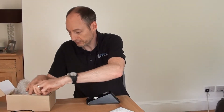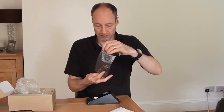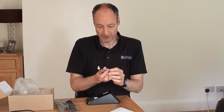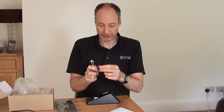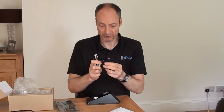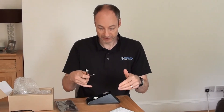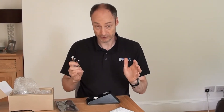In the box we have a packet with a whole bunch of different wires. The one we're going to be most interested in today is this two-wire connector — just red and black — that's your power, plus and minus. A really important thing about the Facelite, just like the Facestation 2, is they don't run on 12 volts. They run on 24 volts.